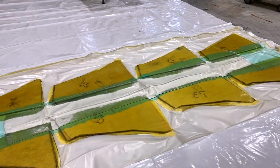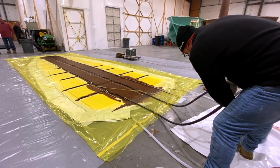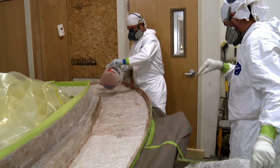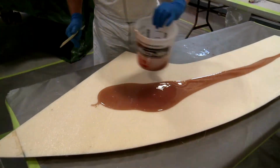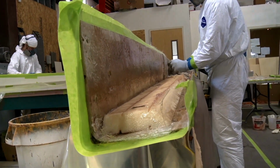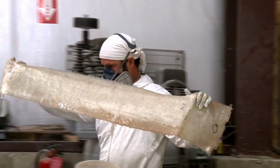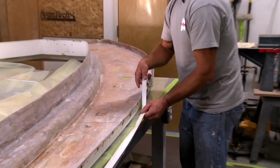Unlike vacuum infusion, we're not pumping the resin into the laminate. What we're doing is something called a wet layup, with vacuum assistance. We first put down 2 layers of 1-ounce mat to act as a glue between the inner laminate and the new core. The men then wet out 4 layers of 1708, taking the time to smooth out all the edges with their hands, knowing that the vacuum bag was going to do most of the work for them in eliminating any possibility of gaps like we found from the factory.